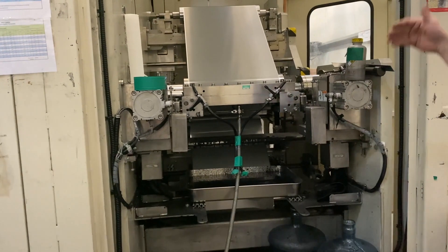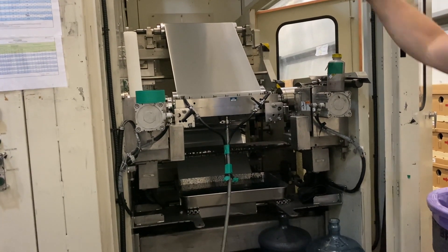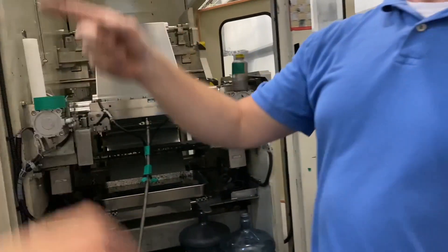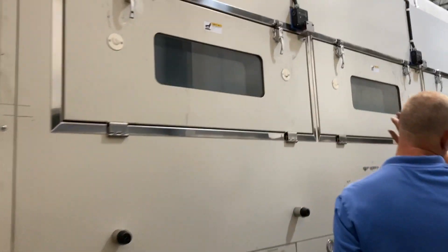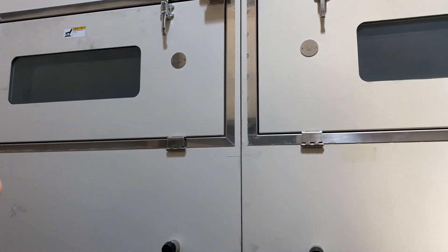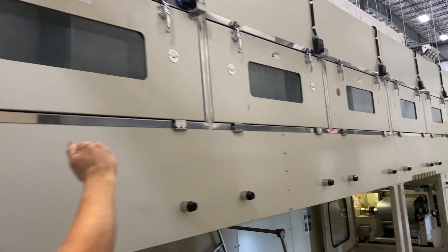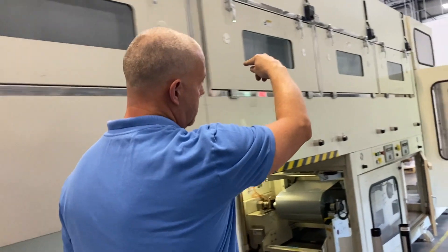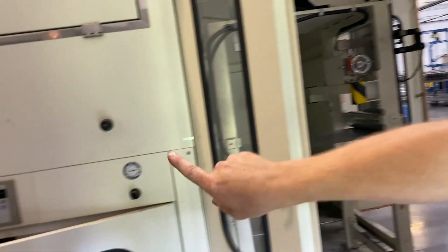This one runs at a higher speed. But they're all the same unit — it's just more heater because you're coating more. It's the same size foil. So in between here and the end down there is just like a huge oven, basically. All the way to that other double door. It passes through and it comes out, so it's just like on a belt right here, going straight through. It coats one side at a time. So you'll have the top coated here all the way through, and when it comes out this end, it goes down and winds it up.